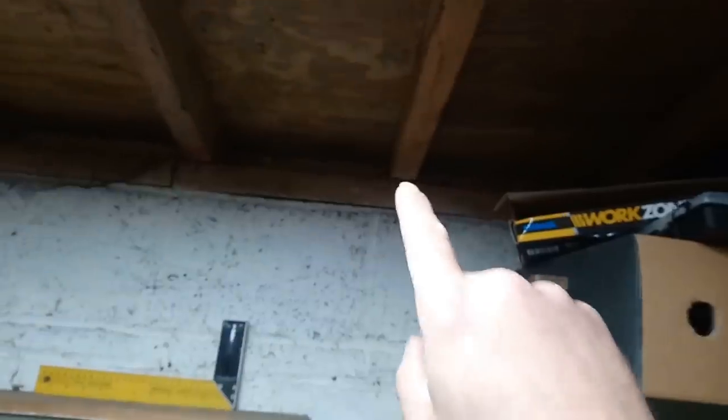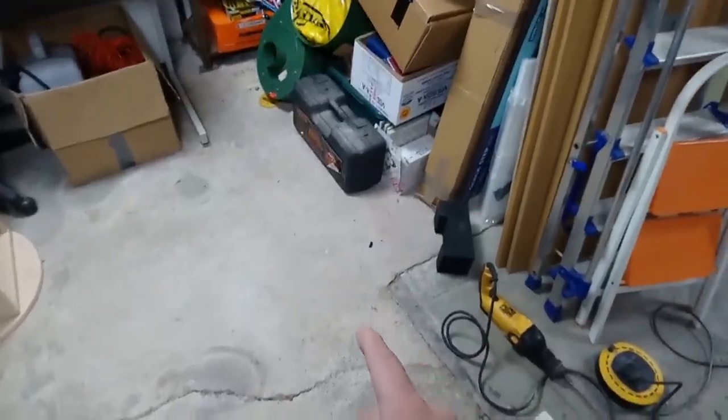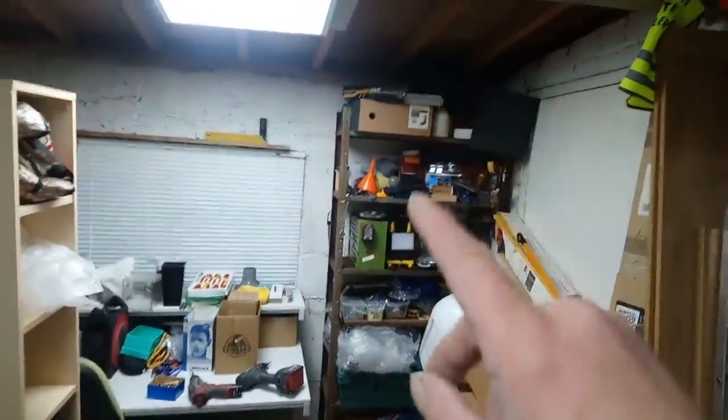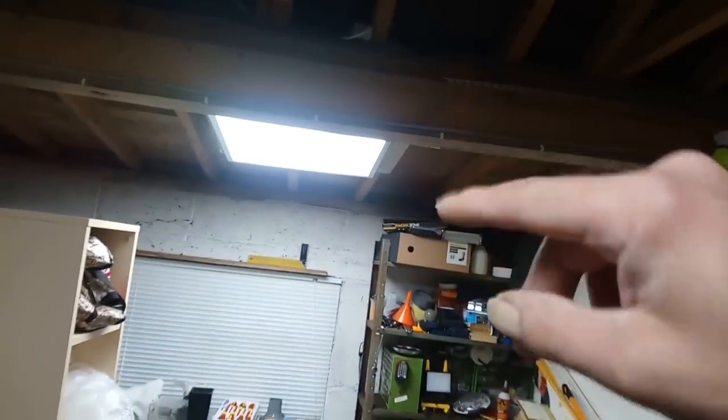Up to the top of that wall plate there is the same height as this beam, so I'm just going to run a timber straight through there. But now I can stand that up in place and fix it around. We're only bringing the wall out to about here for now. And then I'm going to put three timbers in there to create a post. That'll support that beam a little bit more.